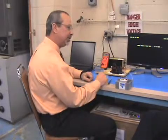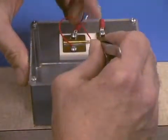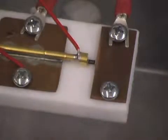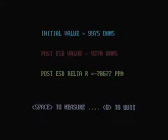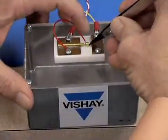Let's start with a thick film resistor and see what happens. Taking an initial reading — it's pretty close to 10,000 ohms. I'll apply the ESD pulse, and let's re-measure this unit. That was only 10,000 volts — you could easily generate 20,000 volts walking across your living room carpet. This unit suffered parametric damage, meaning it changed value but did not completely fail. Would that be easily visible to a designer? Not without a lot of time and trouble — a lot of testing.